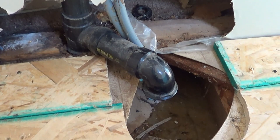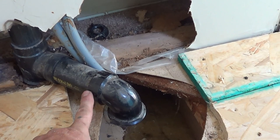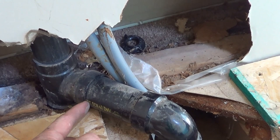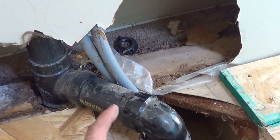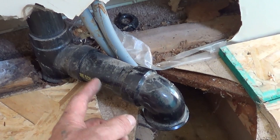Here's inside the bathroom once we pull the tub out. We see this other piece of the P-trap — it's threaded in there and it doesn't fit the new P-trap. Sometimes it's great when this just matches right up to the new P-trap, but sometimes those threads are a little different and this one is glued on, so we'll have to get this off. They left us some pipe here — the fitting for the T, some pipe, then the elbow. So we're going to cut this back and put a slip joint on here that you can screw onto it.